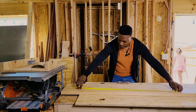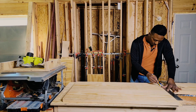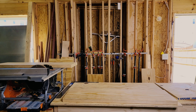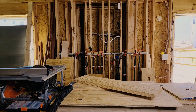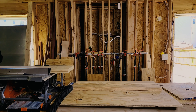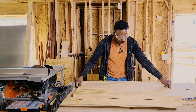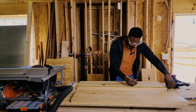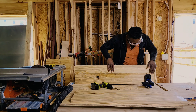This is gonna take about three hours of my time. I started out by measuring the wood — I bought two pieces of 2x12 and split them in two, then joined the two pieces together to get a wider tabletop. You could use glue, clamps, or screws. In this case I'm using pocket hole screws. I measured the width I needed and cut off the excess, ending up with 20 inches wide by four feet long.